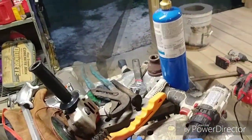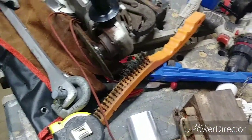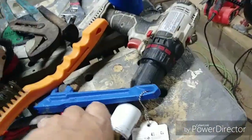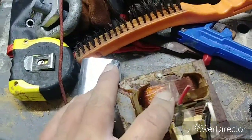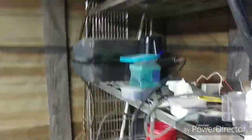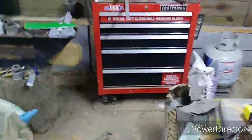I'm going to be building a resistance forge - I've already got one of these torn apart but we're going to rewind this transformer. I've already got the copper wire, I just can't find it - this place is all junked up. You see how small these windings are in this gauge. We're going from that to this two-gauge wire, so that will increase the amperage and drop the voltage. I'm hoping to push about six to eight hundred amps with this two-gauge wire. We'll see how that goes.